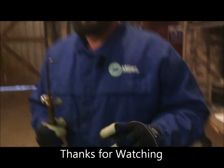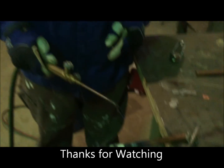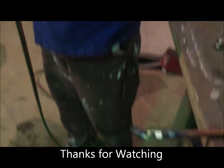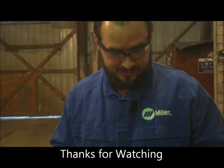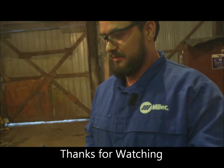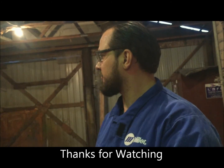Important tip: do not touch the braze or the copper with the tip of the torch when you're brazing, because that clogs up the tip. You'll hear a glob pop. It shuts off the gas, and then you're sitting there turning the acetylene on and nothing's coming out. You try to strike it and you've got to replace the tip — it's all clogged up.